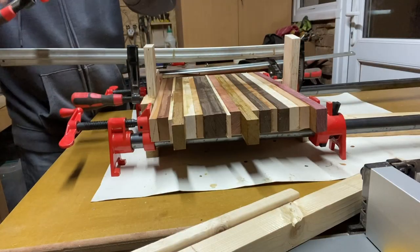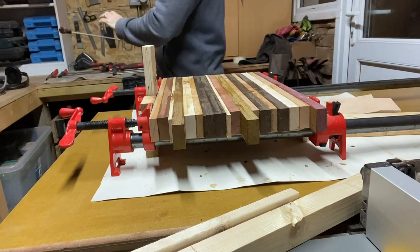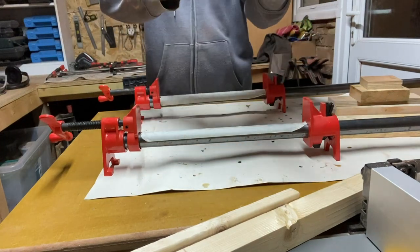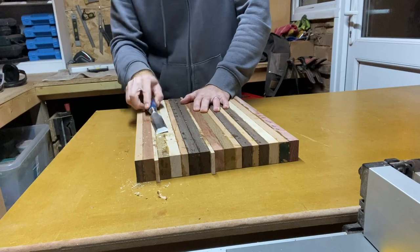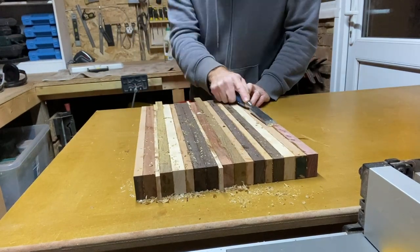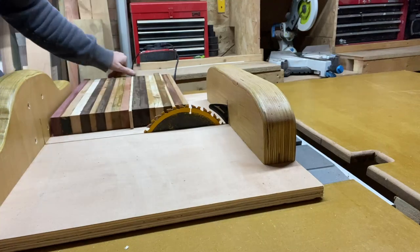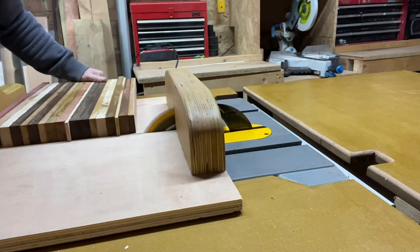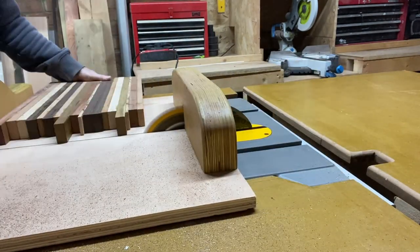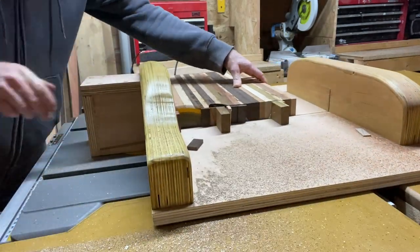You want to make sure the squeeze out is nice and even throughout the chopping board. Once the glue has dried we take all five clamps off. There's a bit of a bead of glue where I didn't wipe the underside, so just go over it with a chisel to clean up any glue or mess. Once it's out of the clamps we bring it over to the table saw and use the cross-cut sled to tidy up the ends of the board, because there are a couple of uneven pieces that are slightly longer than the rest.